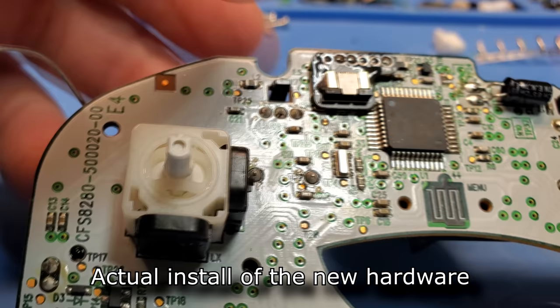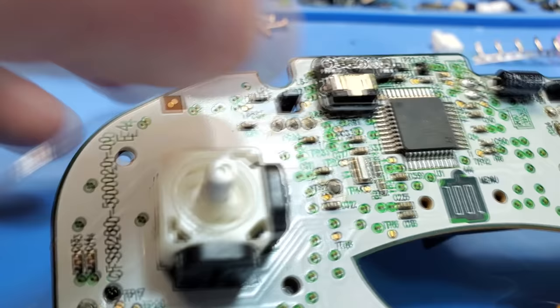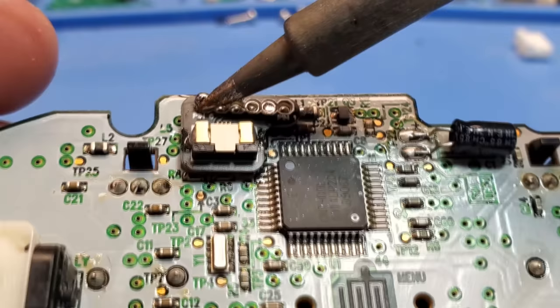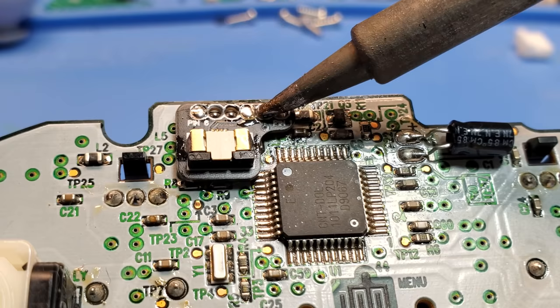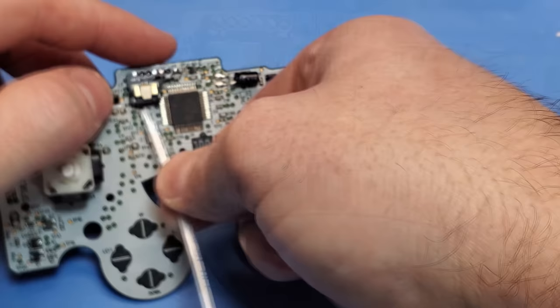The second way is to solder the three points of the QSB and run a flex cable to the main ShineWave PCB. This method involves soldering three points in total and is really easy to do. From there, it is just a routing exercise to make sure all the flex cables are run to your liking, and if you so desire, maybe just a tiny bit of hot glue to hold down some of the flex cables and make everything look really tidy. This is the method that I would recommend, as the soldered connection will always be more secure than a solder-free option and the connections will be more solid.